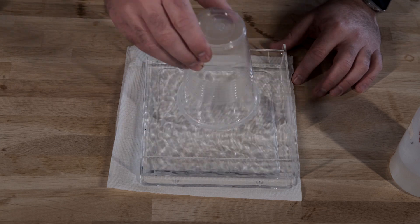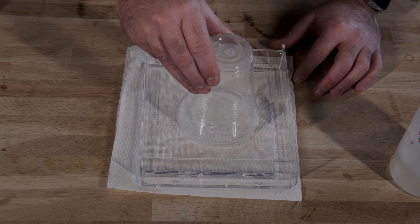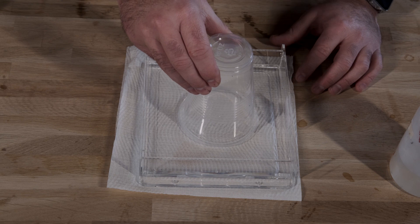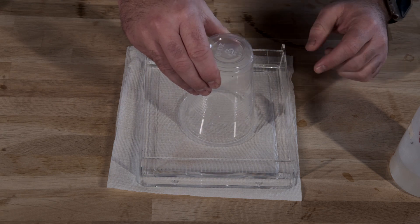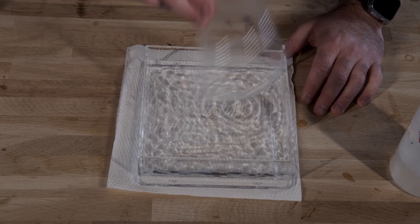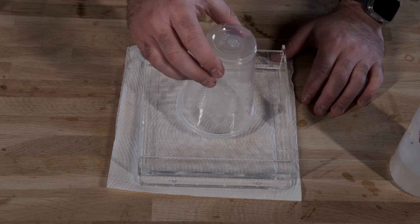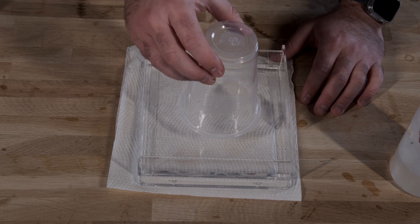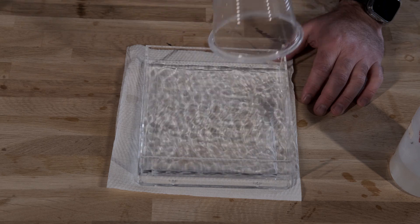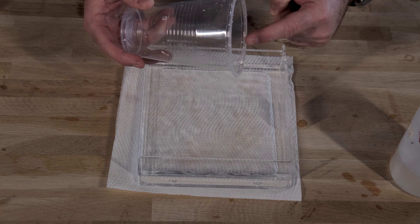It sticks. The reason behind this sticking is pretty straightforward. As we try to pull the print away from the surface, the density of the air inside the cup decreases marginally, which means there's external pressure sticking this cup down and trying to force it to stick to the surface. This is what's happening every single time you print a layer. Your printer lifts up, touches back down, prints a layer and then tries to lift again. And when it does that, each time it creates suction — and that suction is created in the internal cavity of your print.